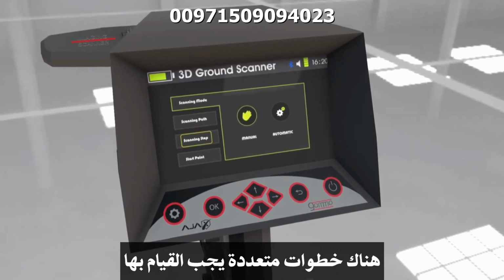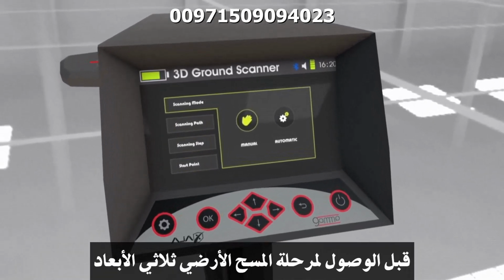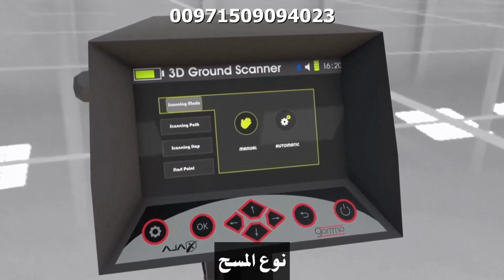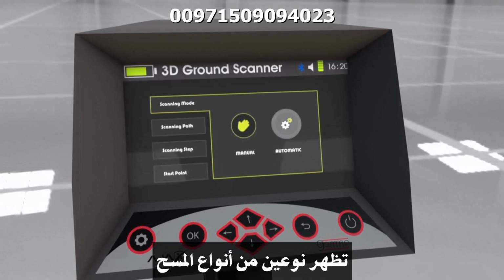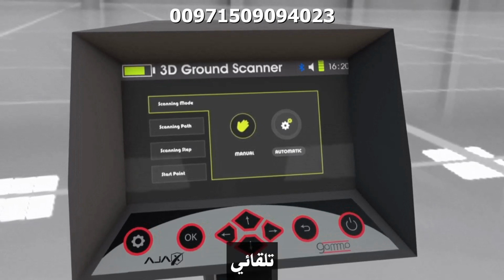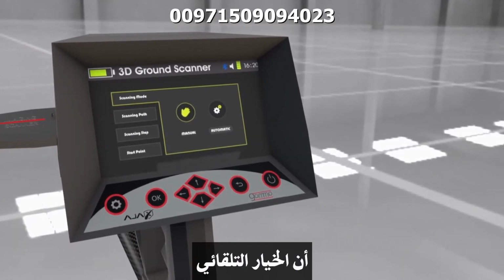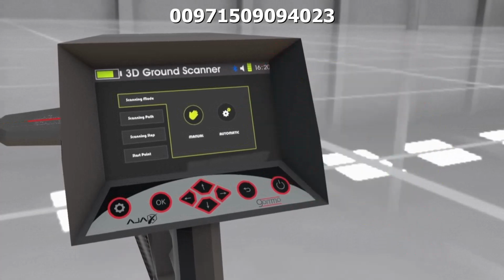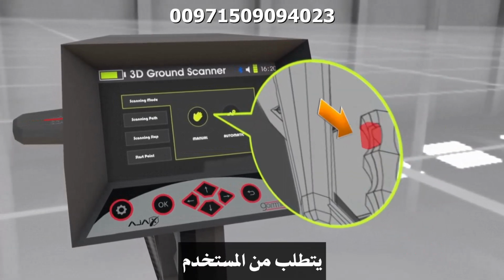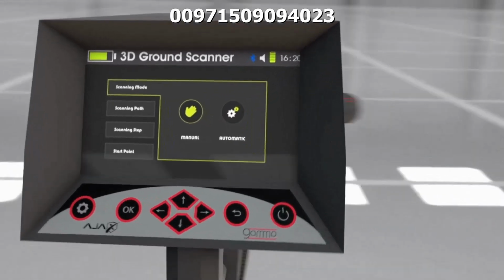There are multiple steps that should be made prior to initiating the 3D ground scanner. A. Scan mode. The options interface shows two scan modes: automatic and manual. The difference is that the automatic mode takes the readings without the need to press the grip key, where the manual mode requires the user to press the grip key to obtain a step reading.